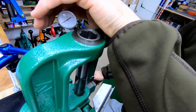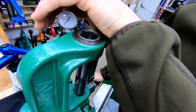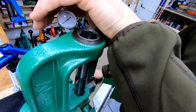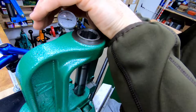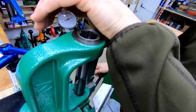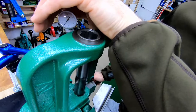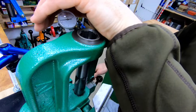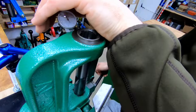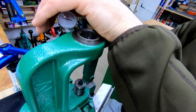Now I press on the handle. See, this is just terrible. See what's happening here. This is why you should never press on the handle. If I let it sink down just gently, I'm getting very nice consistency here. As soon as I press down on it, first of all, it goes back again, then it goes further up. So I'm really messing up the linkage here. This is where we want to be, just a gentle downstroke here.